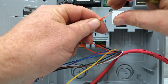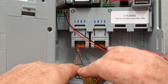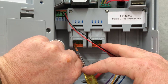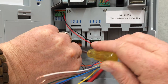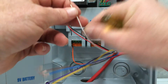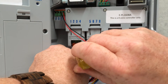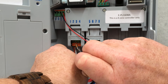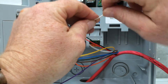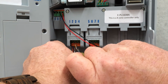For argument's sake I'm going to make station one orange. We push on this orange lever again and these ones come up from underneath. Push on that, get her in — and there we have it, station one. I'll do another one, station two, but you generally get the idea. These can obviously be swapped around as you see fit. If you don't like the way the stations are coming on or they're not running in sequence, the easiest way is to simply swap these wires around to the desired stations you want.